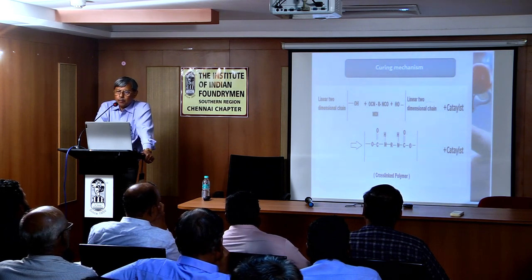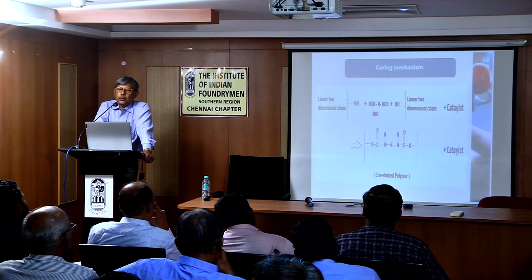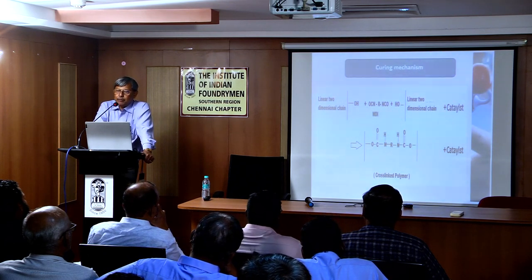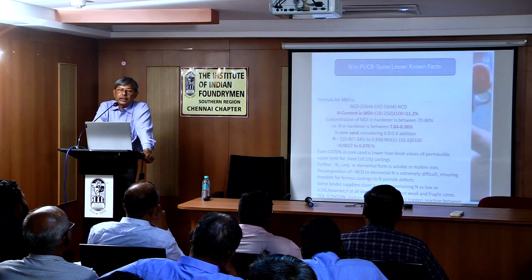So this is the reaction. The OH groups of the phenolic rings react with NCO groups to give the urethane linkage, which gives the strength by converting the two-dimensional polymer chain to three-dimensional.